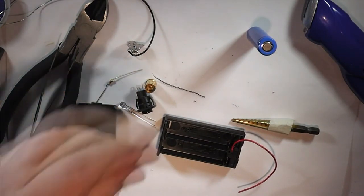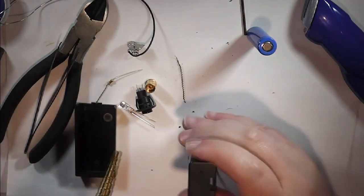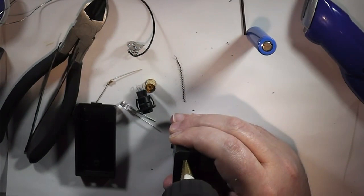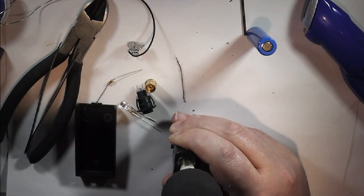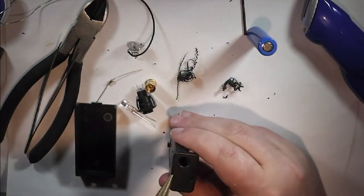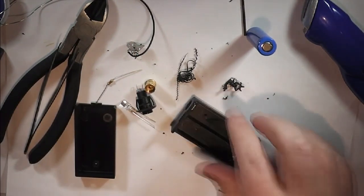So now, finished with the pilot holes, and I'm going to use the step drill bit. I could probably get away without using a pilot hole at all with one of these, but I just think it's easier to start off that way. It's always good technique. So I've pre-marked how deep I want to go for the atomizer connector. So just pop on the hole. Should be the hole done for that.